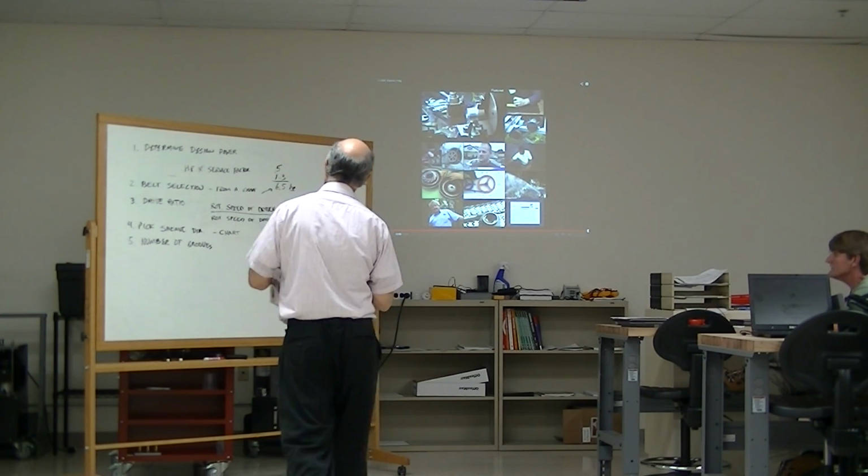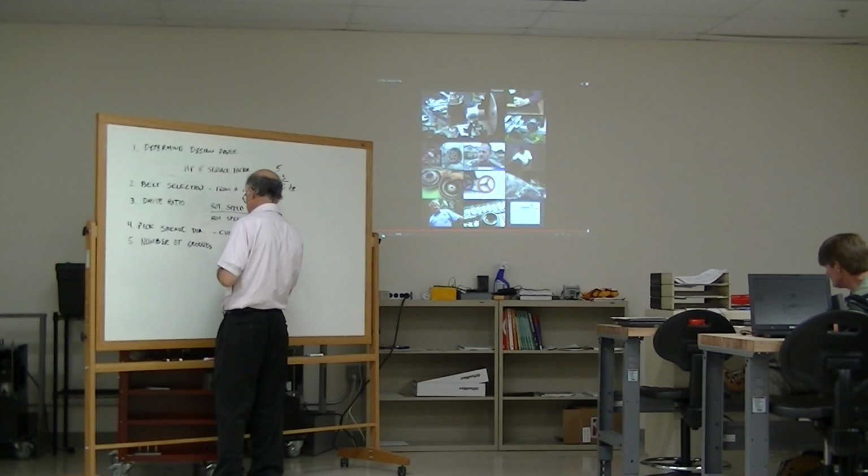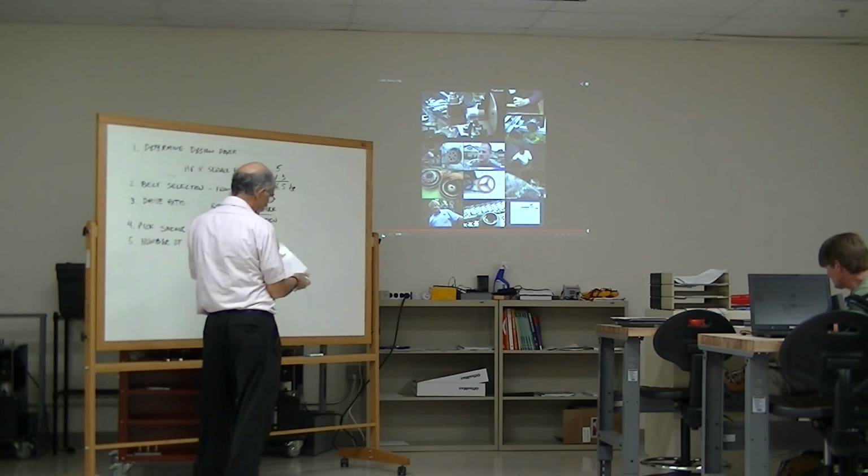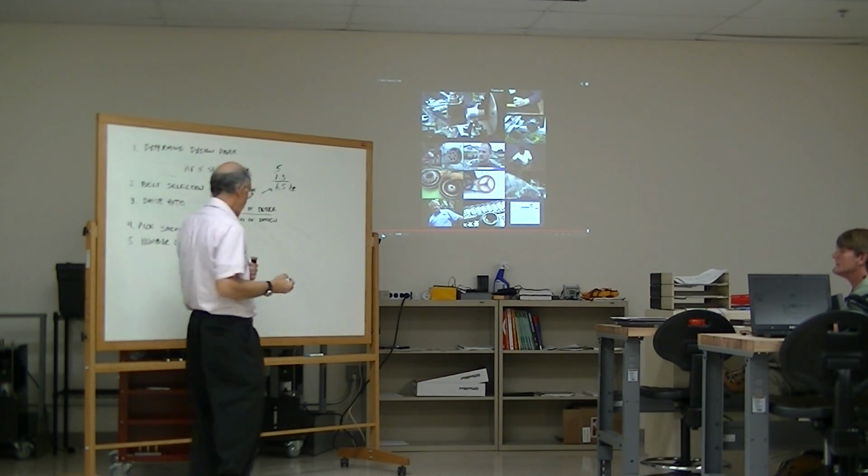So you take the design horsepower, which is this right here. This is the design horsepower right here. So you take the design horsepower and you divide it by the horsepower of the selected sheave. So I guess each sheave has a horsepower rating.